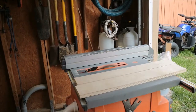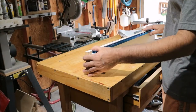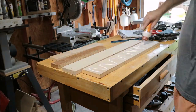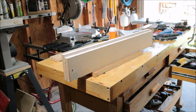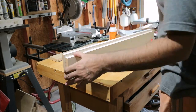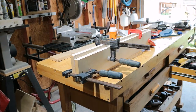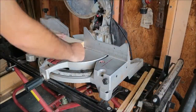First step is to cut the plywood in half using the t-track to measure to get center minus the thickness of the t-track. That'll give me a ledge to put the t-track on. Now I'm gonna glue two pieces together. It'll take plenty of clamps and once I'm done with that it'll take a while to dry. But at the end of this I'll go ahead and cut the ends off perfectly square and to length of the t-track.